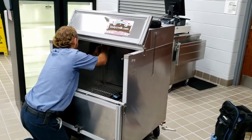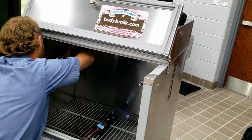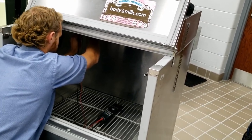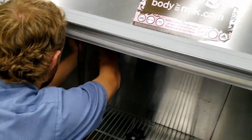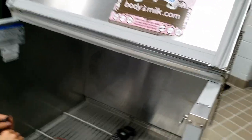Since this has an evaporator - I thought it was just an evaporator plate - I thought the fan would be running but I don't even hear the fan running, so it might be something major killing the whole thing. No power to the stat - not even one leg. Make sure - just because it ain't looping through it don't mean it ain't got one leg possibly. Kind of go to chassis ground to make sure, and I always double check with my light stick as a backup. Nothing at all - that's really crazy. I bet we've got to get into this top panel.